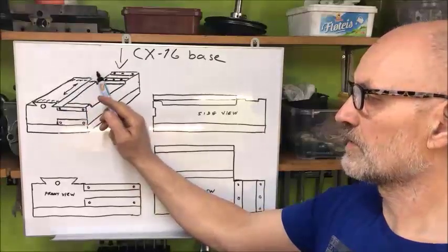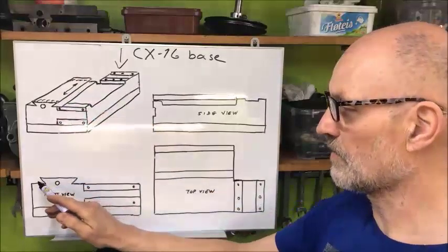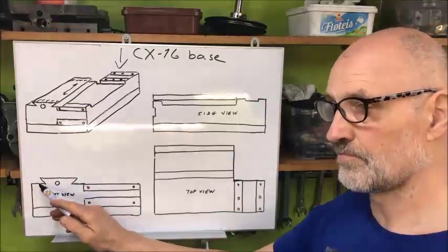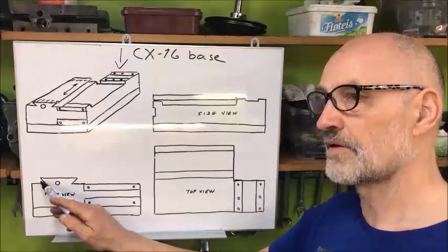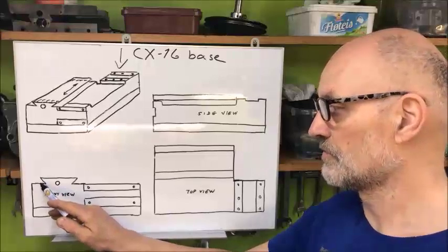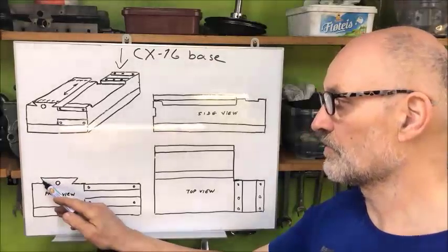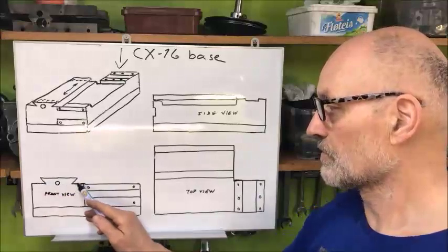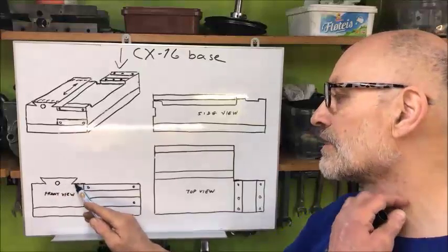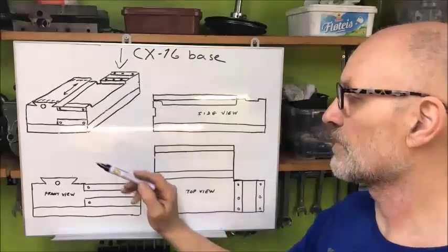Having a long straight edge on here, and then the plate — everything matched up. I proved that the error was really in one of the dovetails, one of them being lower than the other. These were not ideal; the attempt they made to flake it was not really good. I would have wished they didn't try that at all — just to have them ground. So I scraped that down also, so now these are in plane, and also co-planar to those, plus co-planar to the flats here.